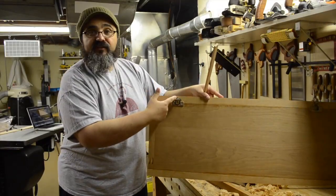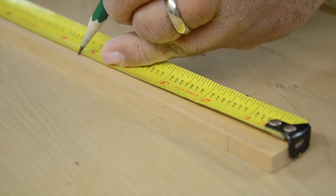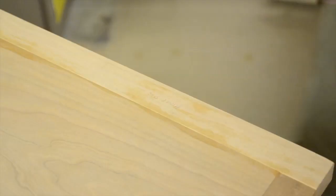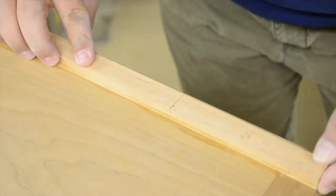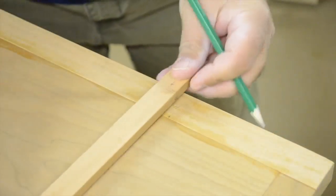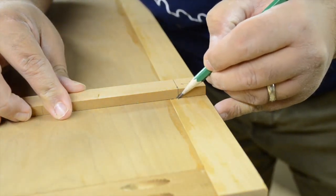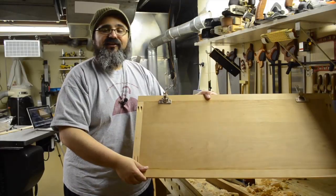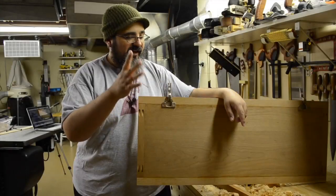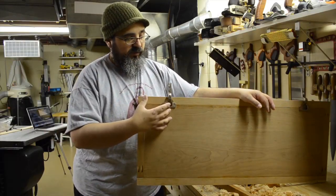Now that I have the dimension for the center in from the edge, I mark another line giving us the center from the top or bottom — approximately 5.85 inches — and repeat the process, striking it across the face. With the story stick complete, I lay it out on the door: come in from the ends, mark that first one, then flip the stick to get the center off the edge and mark it. I can easily repeat this quickly without worrying about being off or forgetting numbers. All four hinges for both doors are laid out in no time — very reliable and repeatable.